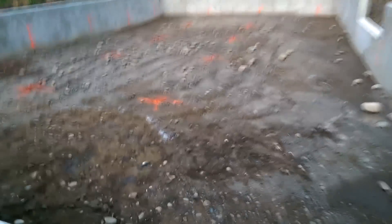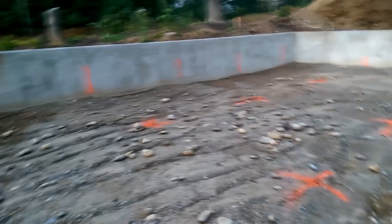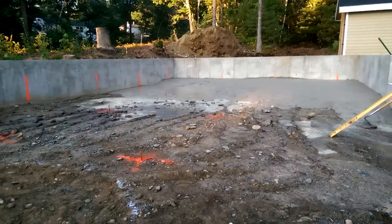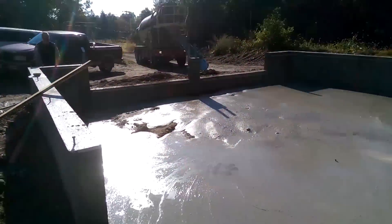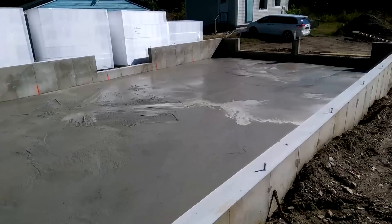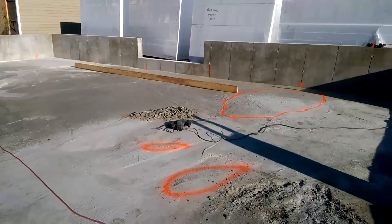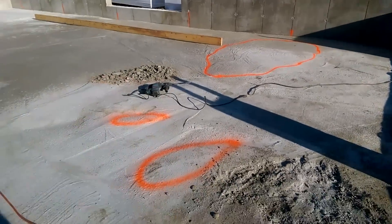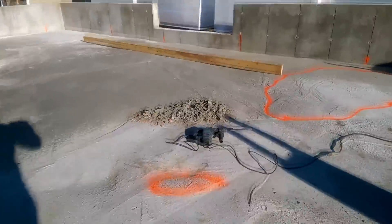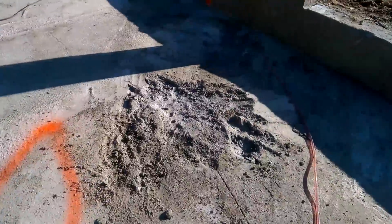After backfilling, I wanted to create a level surface to put the foam board on, so I marked a chalk line all the way around the perimeter and got ready for flowable fill. Now this was advertised as self-leveling, and I even talked to the manager of the concrete company about this, but it was definitely not self-leveling. I had to jump in there immediately and use a board to try to screed it out as best I could, and then as it dried it got even worse — so bad that I wound up chipping out all these high spots using my rotary hammer drill with a chisel point. It wound up being a hell of a lot of extra work. This is something I definitely would have done differently if I was to ever do it again.